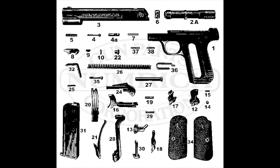Magazine is empty, the gun is empty. I had this out at the range today doing the We Like Shooting Contest and the firing pin broke. What's interesting about the Colt 1903 is that unlike some other firearms, it has a two-piece firing pin. You have the rear firing pin — there's going to be a schematic shown on the screen here, I believe it will be part 4 and then part 4A.